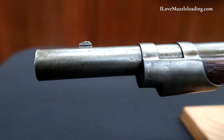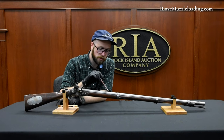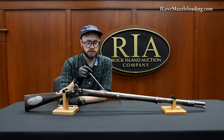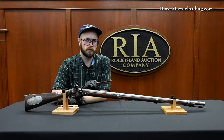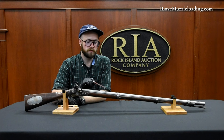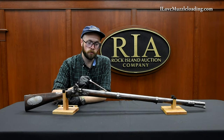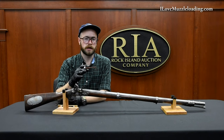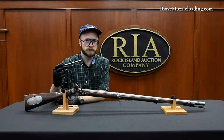It could be that these sights are applied with some sort of solder or brazing in addition to a little bit of metal fitting. These sights are not set in as far into the barrel as we see in some earlier arms and civilian arms of this period. We're getting to a very utilitarian style of manufacturing here — you have your rounded barrel and your rectangular sight base that hasn't been filed away to match the profile. We're moving away from the artistic nature and getting more into utilitarian, industrial design as far as manufacturing goes.